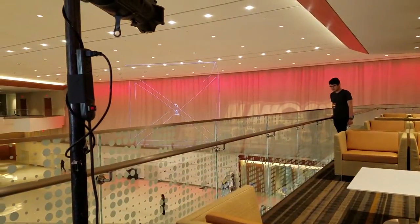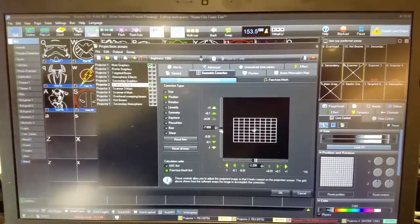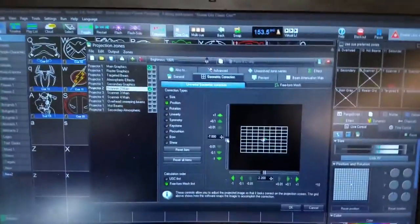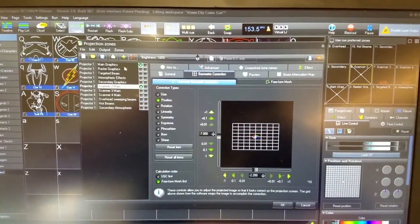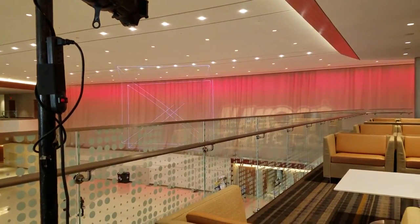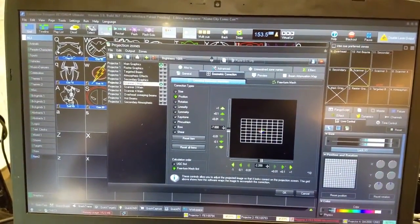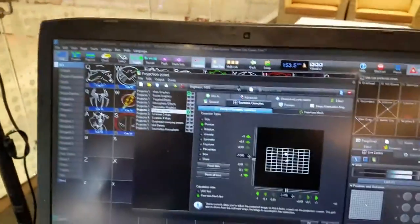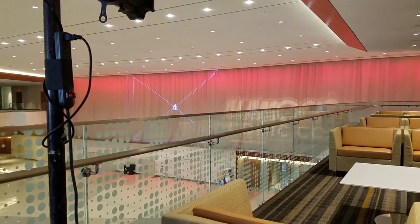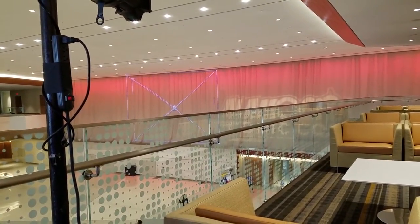If I look at the back wall, I can actually see where my two patterns are projected. The first step is to align the centers of the two images. The two zones I'm using are the main graphics zone and scanner 2. I've already adjusted the relative size — I want my second scan zone to be slightly larger than my first one. So I'm going to adjust the position and get the centers to line up as much as possible, and you'll start to see the centers come together.